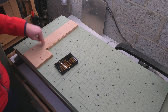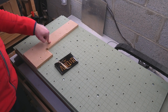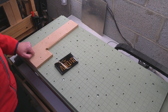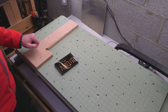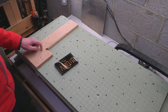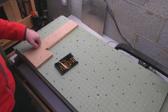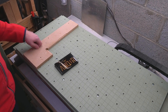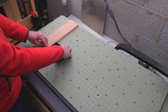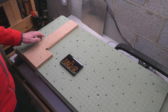So what we'll see today is how to make such a jig, how to make sure it's exactly perfectly aligned both horizontally and vertically, and how to reference the zero point as precisely as possible in the corner. Also how to cut that small hole to make sure that you don't have dust collecting in a corner, which would make your piece not fit completely in the corner and could cause it to move around and not be very precise. So I'll make a new one.